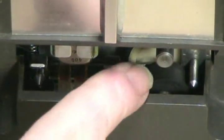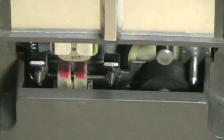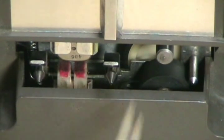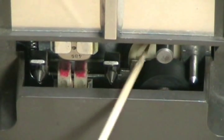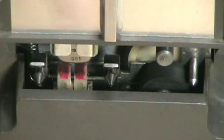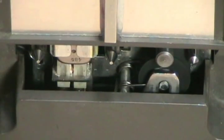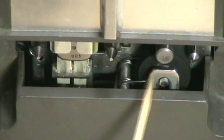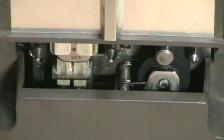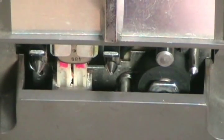You can see here the spinning capstan and the pinch roller. Here is the record/play head with the erase head built in, and underneath it are two little pressure pads — red for the erase and for the record/play section — and they are on plungers. There is also in here a cam, called a power cam, and that is what makes the mechanism work because everything here is controlled by springs. These are feather-touch controls — that is what Wollensak calls them. When I put it in to start, notice that the cam turned allowing the mechanism to come forward. Now the pinch roller is engaged with the capstan, and you can see the two plungers holding the pressure pads which would hold the tape against the head. At this point you can use your pause control.